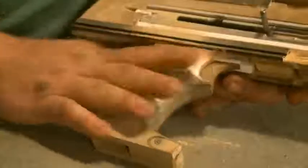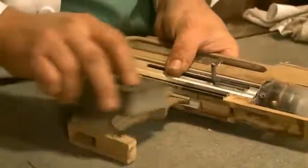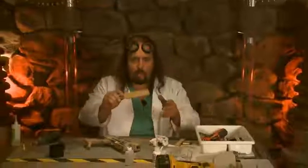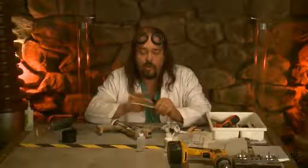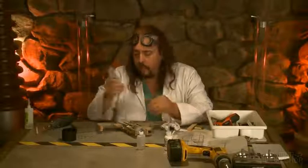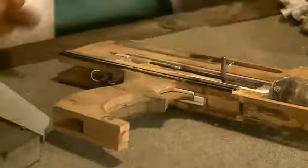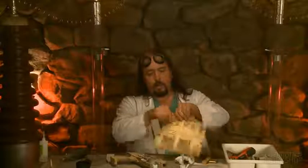You want to kind of feel it out too — feel what it feels like, whether it feels natural in your hand. Your finger comes across here as ergonomics, your thumb goes in through here like that. Then once you've got that, you can hit it with a sanding block to kind of smooth it out. Or if you need something more heavy duty, you can make these yourself out of a piece of wood — just a nice sanding block with 100 grit on one side and 220 on the other. Take some spray adhesive, spray it on both sides, stick it down, cut it out with a razor blade. It gives you like a chisel that you can work with. But since this is an organic shape and I want it to be smooth, I need some 100 grit sandpaper.